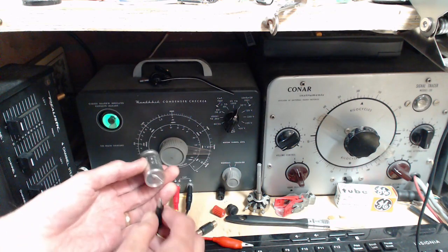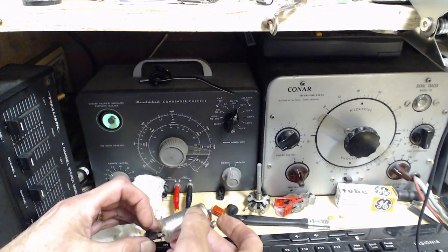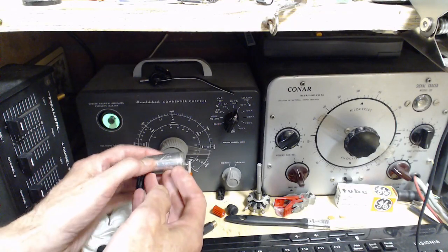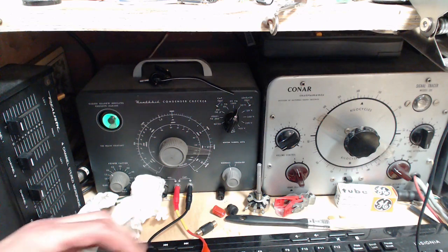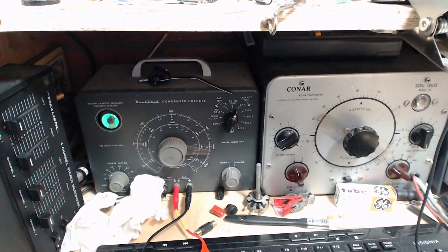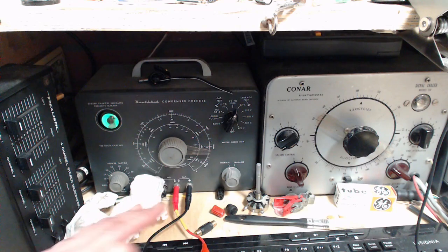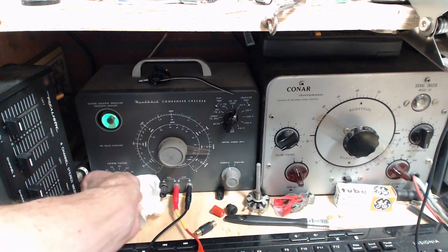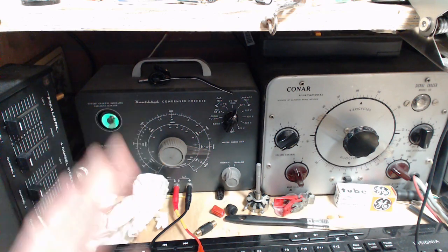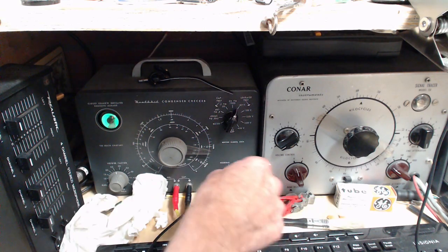Polarity, right? It looks like negative to me. What we're going to do is stick 50 volts on this capacitor, whose actual rating is 150. If you haven't seen this done before, you see the eye is slightly open at the bottom. I'm going to apply the voltage, and current is going to rush into this capacitor. The eye will close while the current flows, and then the eye will open. If the capacitor is really in good shape, it'll open just like that again. If it's not, it won't open, or it'll only open partially.